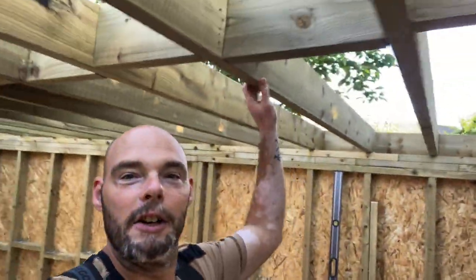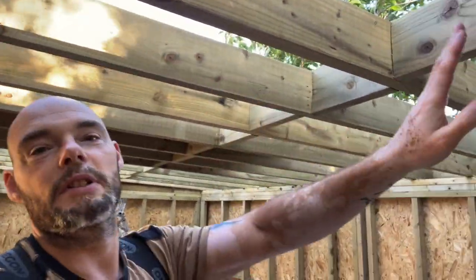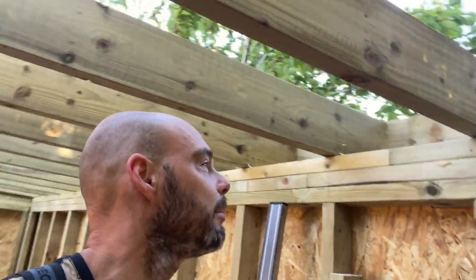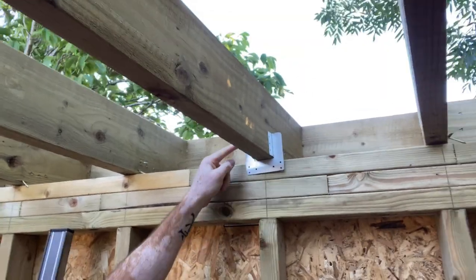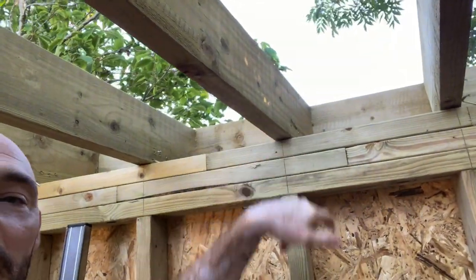If you weren't here yesterday, roofing parts are all now in - all the roof joists, all the noggings, it's ready to rock and roll. All the trimmers are on the side, all the soffit hangers, it's all ready to go. First thing I'm going to do is whip these truss clips up like this - tacked in there, tacked in the side. They're already spiked in at the angle, three going that way, three going the other way, so they're not going anywhere. It's over-engineering but now's the time.